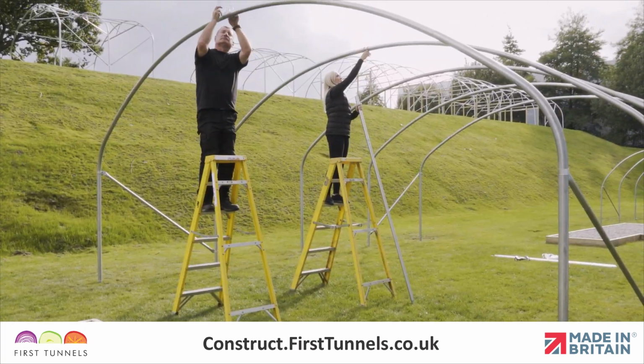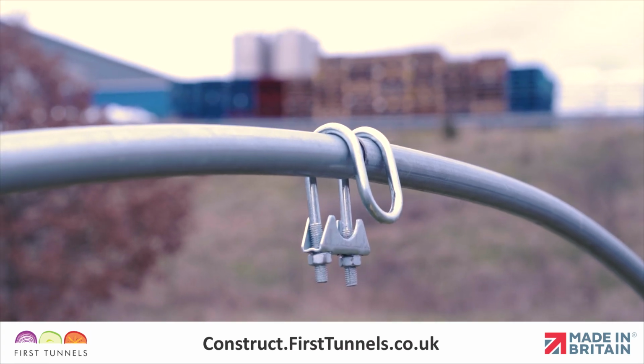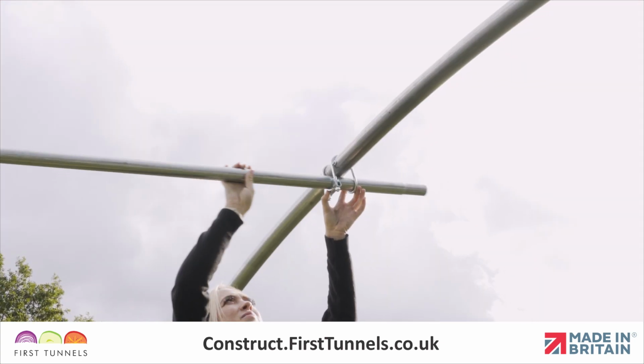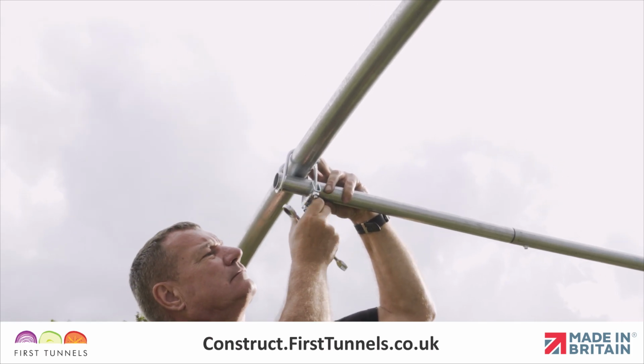Position a ridge clamp on the first and second hoops centrally on the apex. On the end hoop, ensure the threaded section of the clamp is to the inside of the polytunnel. Slide the ridge tube through both ridge clamps, ensuring the plain end is on the end hoop.